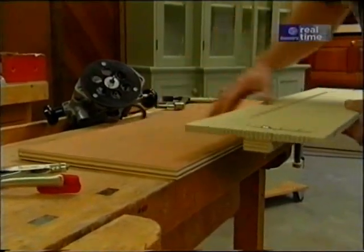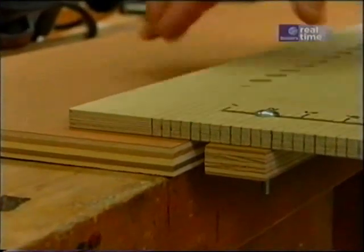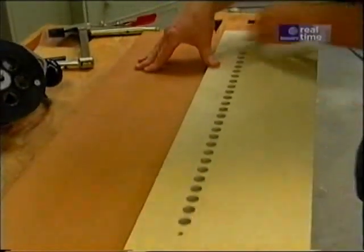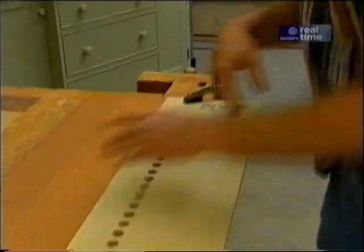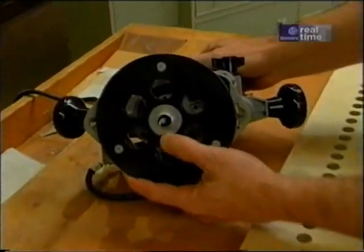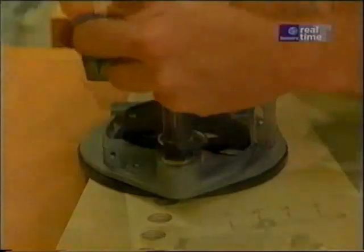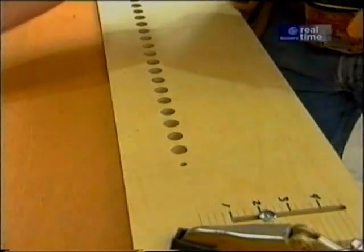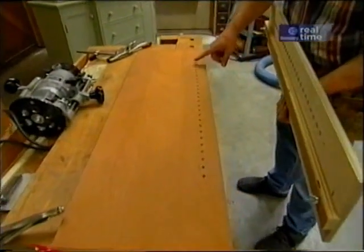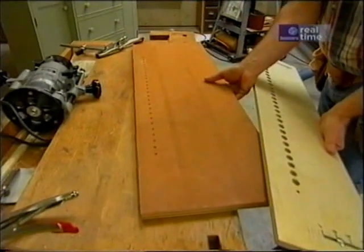Let's try it out and make some holes in this piece of plywood, which could be for a mythical cabinet. I've set the stop so that it's an inch and a half from the center of my holes. Just run that up against the side of the piece, come to the middle, line up the center points, and then clamp the whole assembly to my workbench. I've installed the collar in my router and I have a quarter-inch spiral bit. The depth is set so that it'll cut a half inch into the plywood. I start at one end and work my way down. Pop off the clamps and we have a nice series of holes, evenly spaced. Now to do the other side, I just turn the piece around, set it up again, and do the same thing.